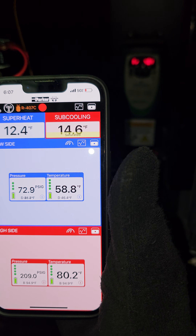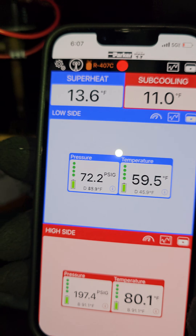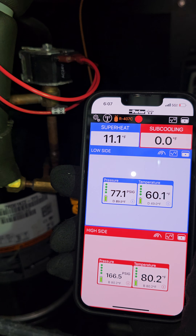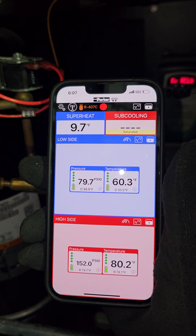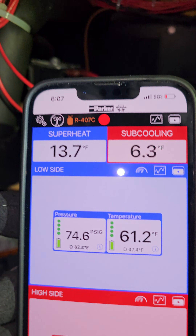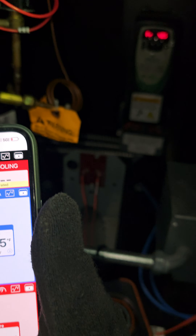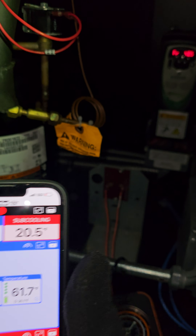As the digital scroll loads and unloads, you can hear the compressor and you can see how your pressures and temperatures are moving all over the place. So if you're trying to charge refrigerant while this is happening, it's going to be a nightmare. If you don't know what to do, you'll really go nuts.